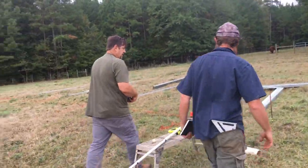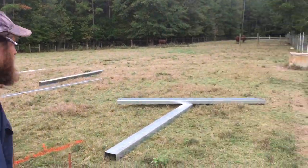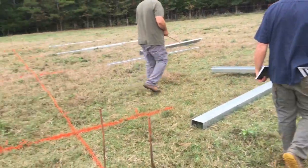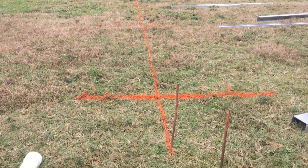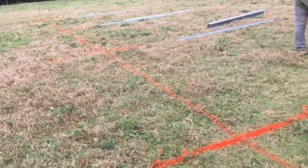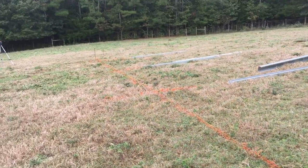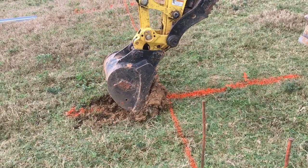We've got our steel, our Sinclair as always. This time we're going to be doing it on 14-foot centers instead of 17-foot centers. We've got a post laid out already and we've got our array strung out and painted on the ground where the intersections are — that's where we're going to be digging. So we're already on 14-foot centers and we're about to start digging some holes.